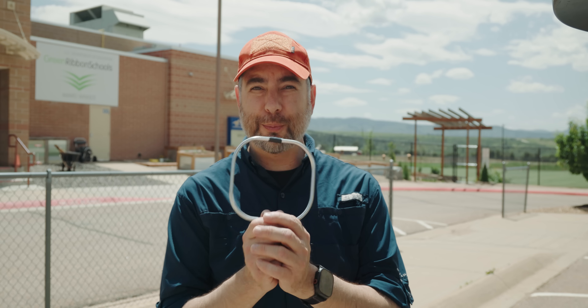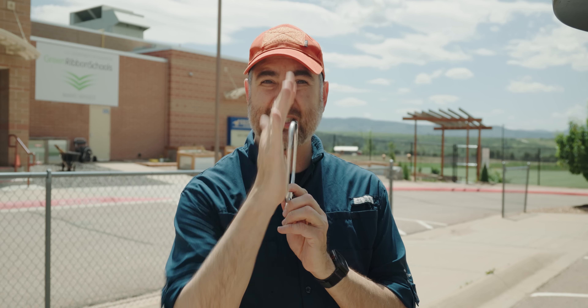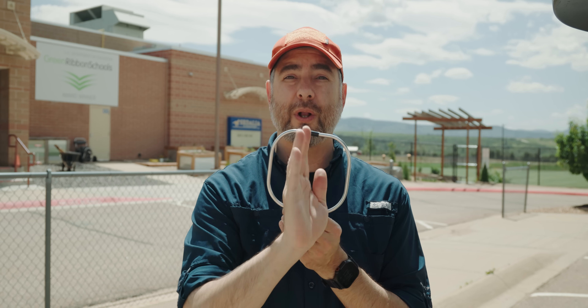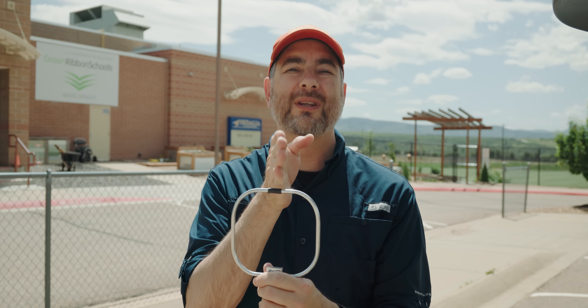The GPS antenna has a little receiver inside and it knows where it is. I can put a map in the spectrum analyzer, and it makes interference hunting so much easier. Now, the loop antenna is sensitive in the direction of the loop — sensitive this way and that way — but it's not sensitive in this direction. This is called the null. The sensitive section is pretty wide, so we're not going to be using that. We're going to be using the narrow null.